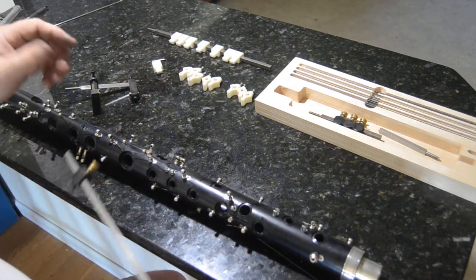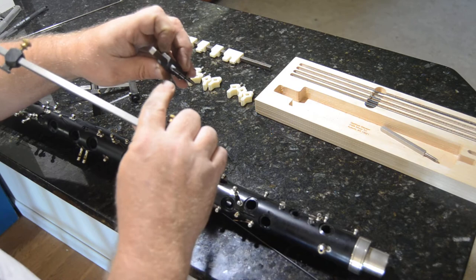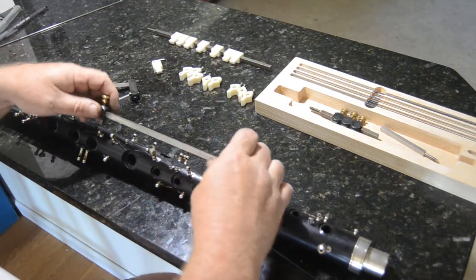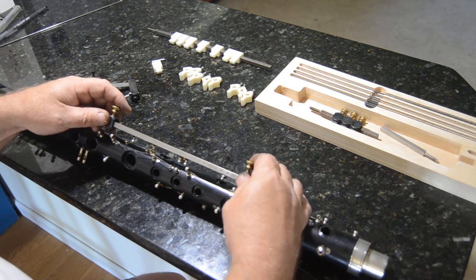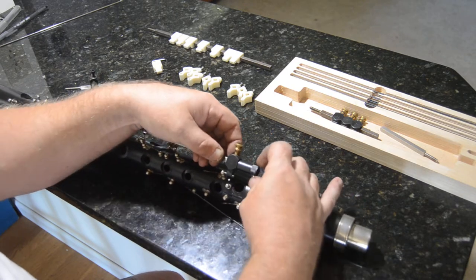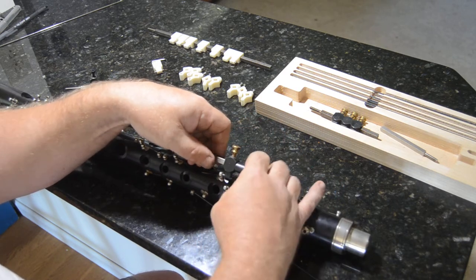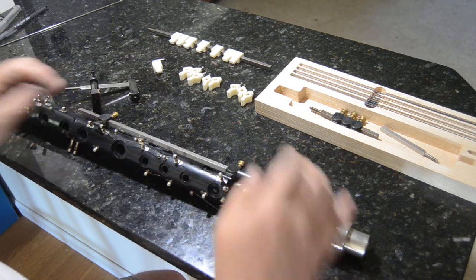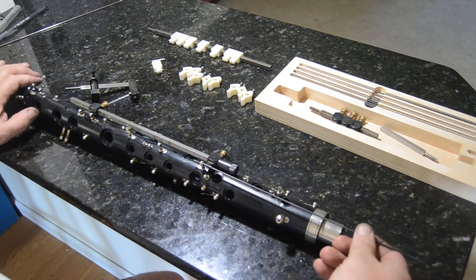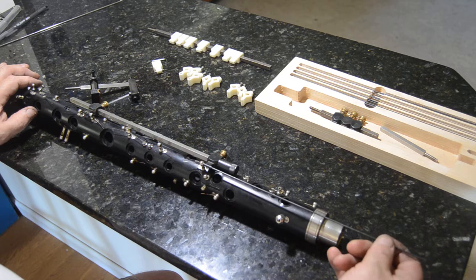So if you're having to drill out a screw you could use one of the ones with the drill guide on the end to fit around the screw, or if you're drilling a fresh post — one that hasn't been drilled before — you just put it on centered like this and use the tightening screw to tighten it against the post, not too tight, and then lock it down so it won't move, and then select the right size drill. I just buy foot-long aircraft drills and then you can use your bench motor or hand drill or whatever and drill the post.